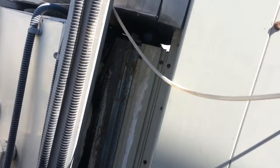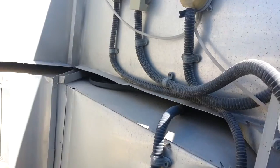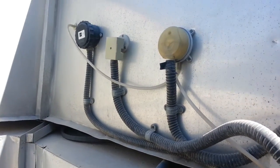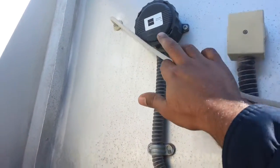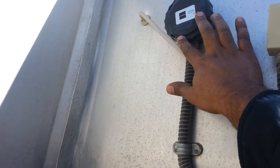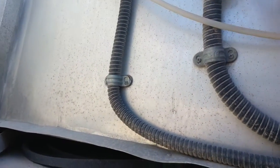Here is the filter of the unit. If the filter is blocked, it creates a vacuum and this module will sense it — the machine will give an indication inside the DDC panel. All these are connected to the DDC. Here there is a temperature sensor and an airflow sensor, sensing the airflow and temperature inside the duct.